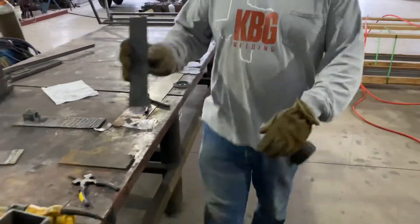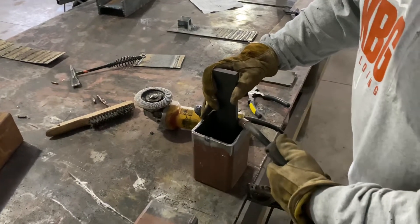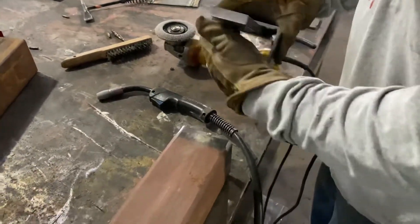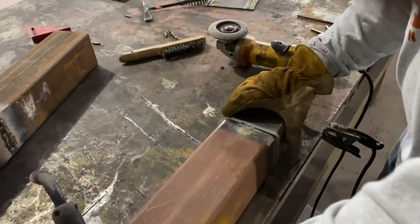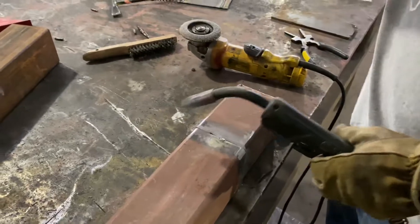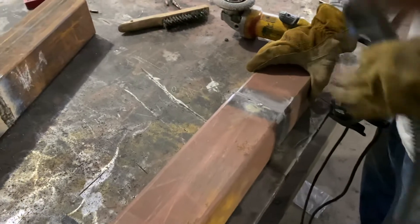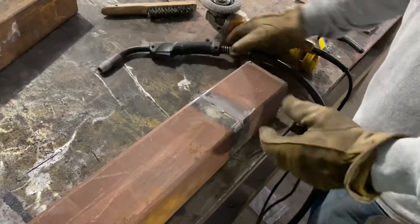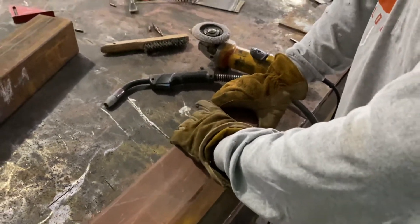If you put a stiffener so it's able to line up, then tack that in there. When you make your weld, you can do a better attachment there. It gives you a backer plate when you insert it, so you have something you can actually burn off of. The whole point is you've got to get complete penetration — that's what the bevel does. You can put the backer plate or not, but it's just a helpful option.